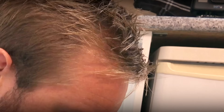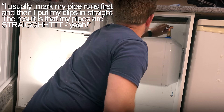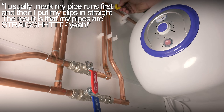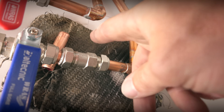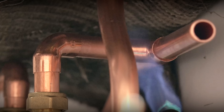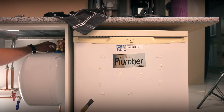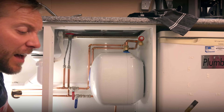I usually mark my pipe runs first and then put my clips in straight — the result is that my pipes run straight. We've got our shut-off valve and our non-return valve, then a T going down to our little expansion vessel. We need to rise all of that up and bring it together at the top. We're getting ready for some soldering — I never knew that soldering could be this much fun or so relaxing.